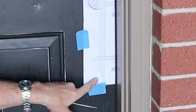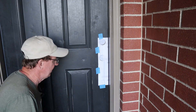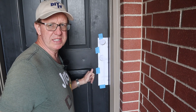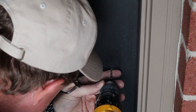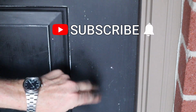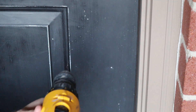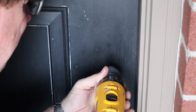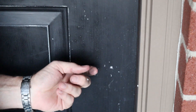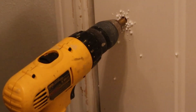This particular set is adjustable, so I've got some room to make an adjustment. The biggest thing I need to do is make sure I'm dead straight in. I'm going to drill a pilot hole with a one-eighth inch drill bit, then come back behind and drill with the seven-sixteenths that they recommend. My shot stopped short and hit styrofoam — I'm going to go through and punch through to the other side, making sure I'm good and straight and level. When I drill my seven-sixteenths bit, I'm only going to go through this side, then go around to the other side and drill through that way.